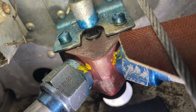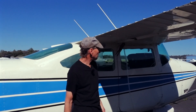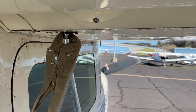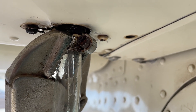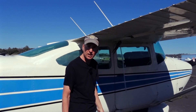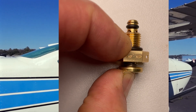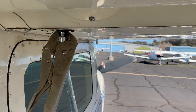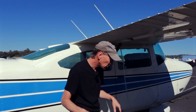I need to work on the fuel selector valve again, and in order to do that I have to get rid of the fuel. I have figured out a great little system here: we have vinyl tubing, a hose clamp on the outside of the vinyl tubing, and then we use these vice grips to hold open the fuel drain valve — that's what they're officially called. There's a spring that resists it so fuel won't leak when you're flying, and it's a lot of work to hold it open, so we use these vice grips. It's a pretty adequate flow.